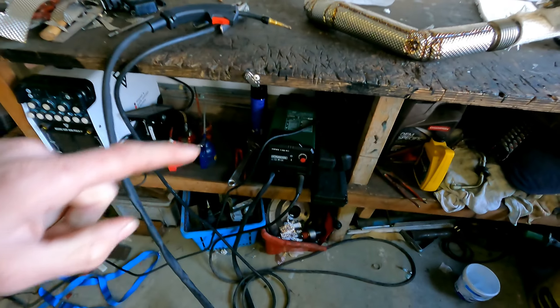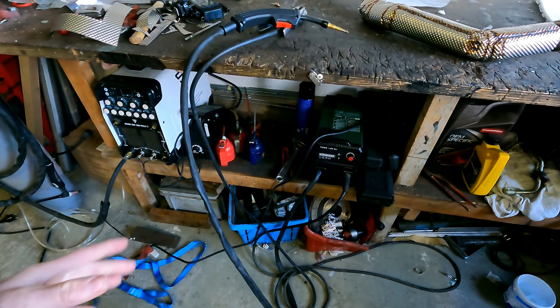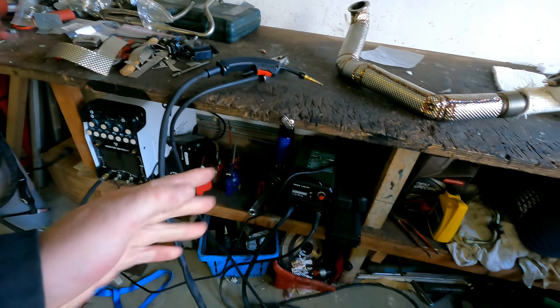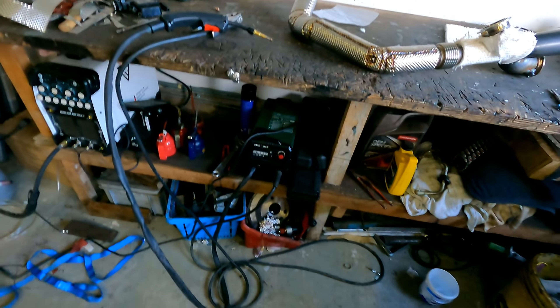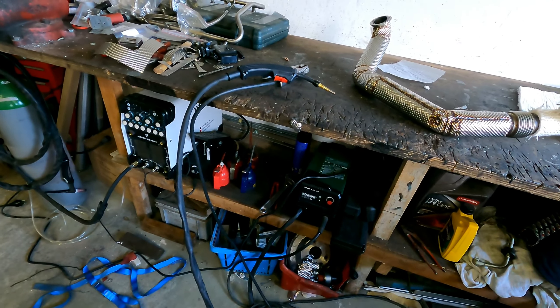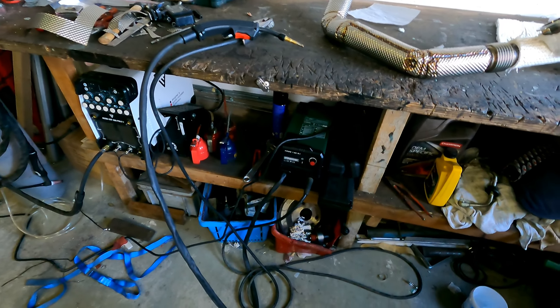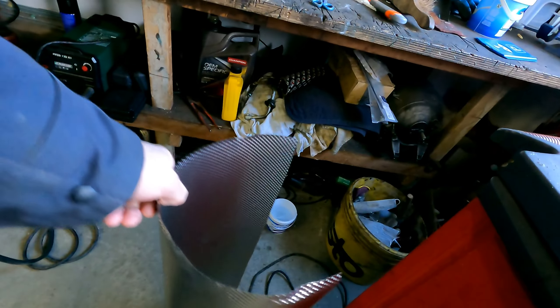What I'm going to do in the future is modify this machine and add a tack function using some electronics, so I can get a timer from zero to two seconds to control how long it puts power through. If you have a more expensive MIG machine with a timer function and you can lower the power to maybe 15 amps — I think 15 amps is the lowest you can get on a MIG welder. Also, you need a very thick minus cable because the original one will melt.